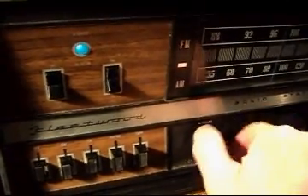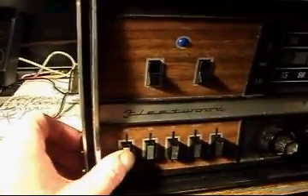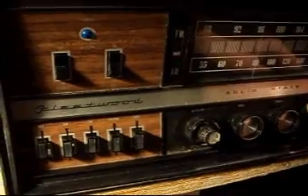I've cleaned up the controls and tuning capacitor and I'm getting something. One side is weak, as you can hear. I checked AM as well — it's working good enough. I don't hear any hum, but the on-off switch is a little iffy. I'm going to try and give that a clean — I don't know where you'd get another one. Tough to find.